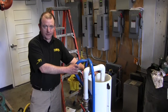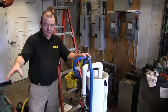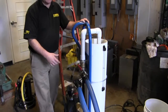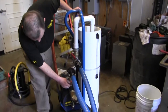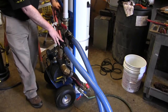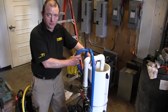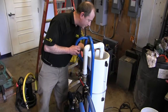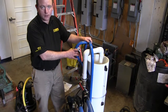What we're going to do now is finish draining out this tank. Make sure that all valves are shut off at this time, and shut the valves off in the system. Disconnect the hoses, keeping in mind that you still have water in these hoses, so be careful you don't dump it all over the mechanical room. To finish dumping out the tank, down here we have a power dump — just connect a regular garden hose to that with the machine running and crack open the valve. The motor will start pushing water out, but keep an eye on the water level because you don't want it to get below the impeller level at the bottom of the tank, or it'll suck air. You'll probably have about a quarter to half inch of water left, then just carefully roll the tank over and dump the rest out.